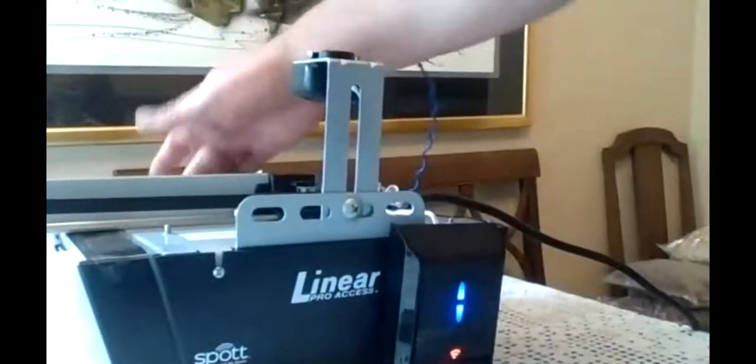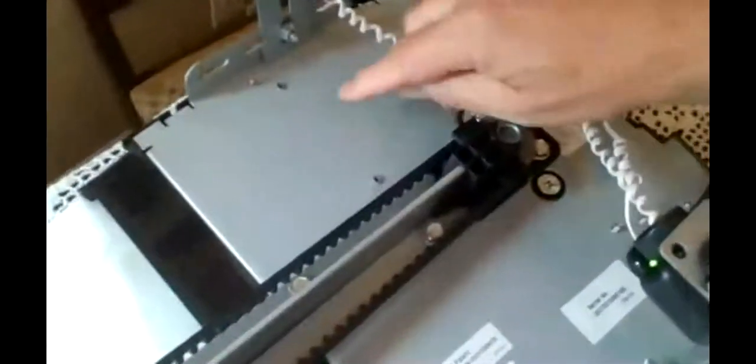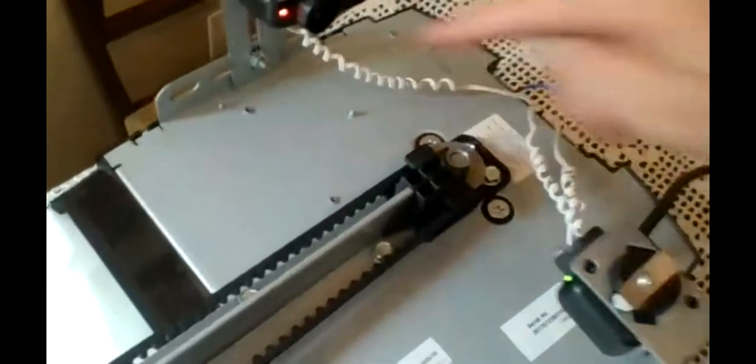Yes, and then my next question is for the backup battery units that do not come with the 800 but will come in a separate box for the 800s. Are those mounted above the unit, like on punch angle, or is there a bracket that houses it? The BBU comes in its own separate box, and that goes inside the motor housing. See the 4 screws? You take this housing off, and you can see these screw holes here. That's where it goes on the inside.